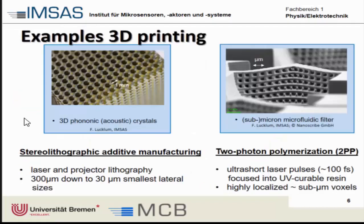There are a few methods — probably all of you have seen nice contributions on 3D-printed devices also at this conference. If you use stereolithographic additive manufacturing, you have a laser that shines light on the stage from the bottom and writes structures by illuminating each photosensitive layer. However, for our channel structure it is technologically not possible to use this technology, and the feature sizes are on the order of the channel size — we cannot get down to two micrometers.